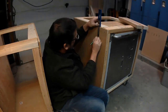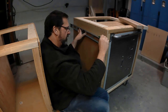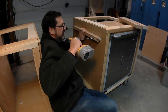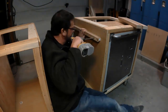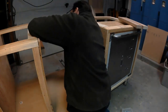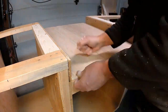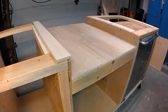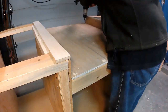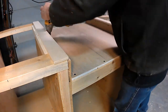Now we're going to locate where the saw is going to sit. I'm taking a dimension directly off the saw to locate where the top of the table that's going to hold the saw is in the middle. We'll put a brace up, get it lined up, screw it in, and do that on both sides. Then I'm going to put a four-by-four across the front and the back to hold the platform and hold the saw up. Then we'll attach that top, bring the saw over, and level the saw with where the top's going to go.